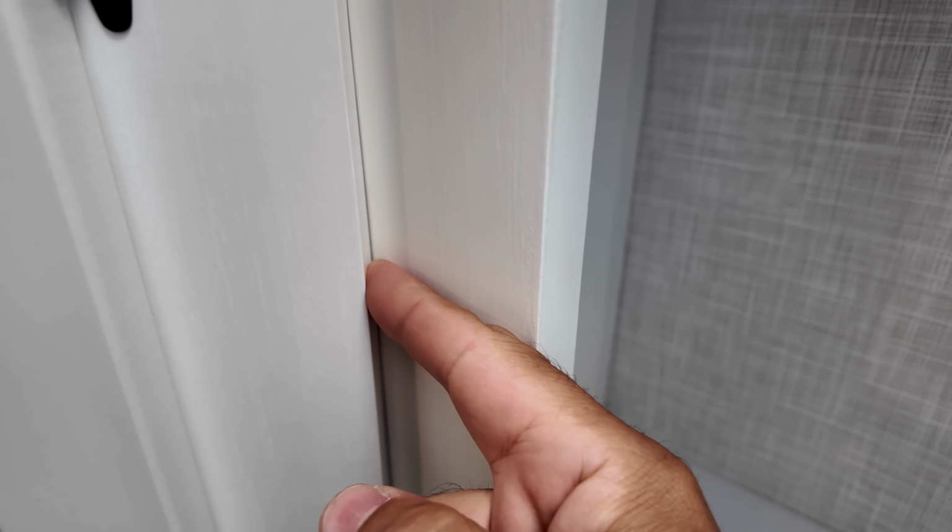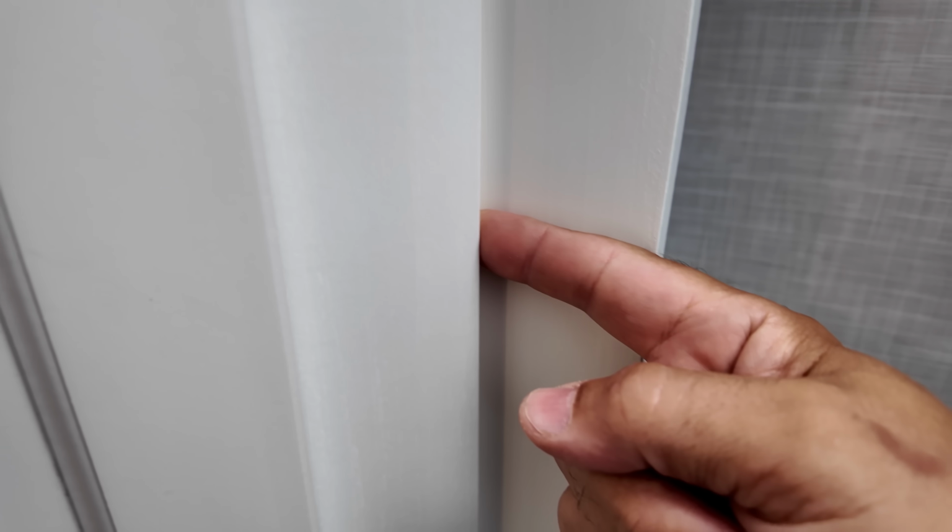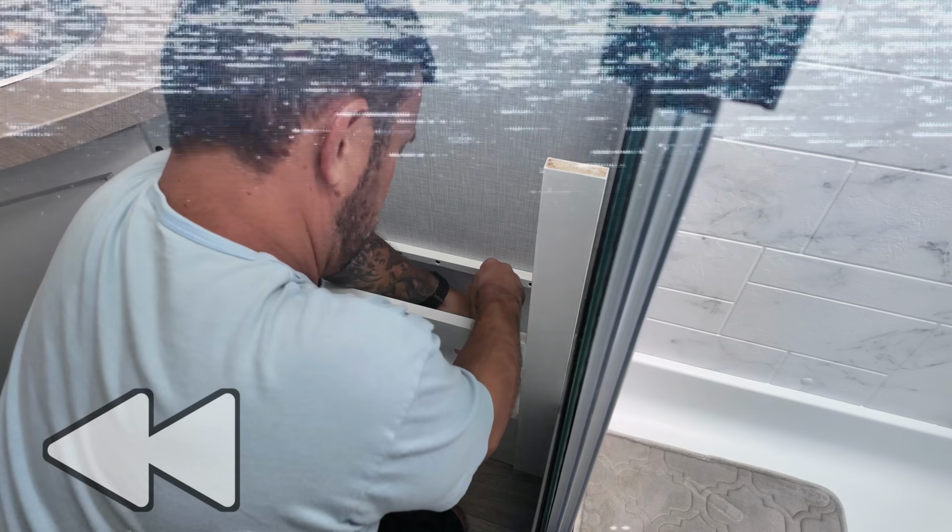So you might be asking, why not just staple this whole thing together outside and install in the bathroom as one piece? The reason is simple, I can't. There's a lip on the front of the factory installed cabinet that I wanted to overlap the cabinet we're building. Plus, the factory countertop overhangs this cabinet, so it can't be slid in or slid down. There's just no physical way to get this in place as one piece. But that's a good thing because it can be removed without being destroyed. Hopefully I'll never have to remove this, but it's nice knowing I can.